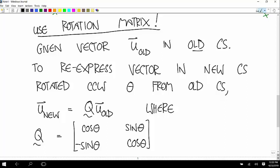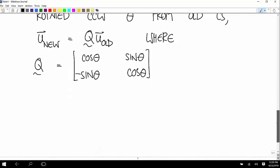All right, so here's our rotation matrix. We're going to come up with the rotation matrix, and then we're going to multiply it to each one of these force vectors. Do we know the angle of that beam off the top of our head? It doesn't give it, does it? Okay, so we'd have to figure it out. We have to make a right triangle out of that, and well, that won't be so hard. Let's see.